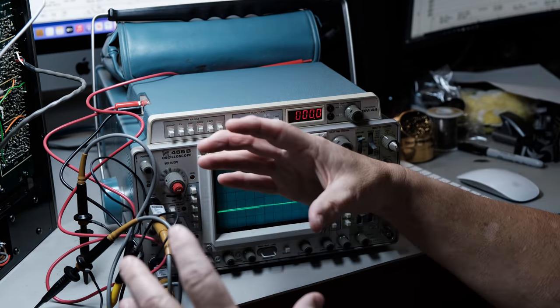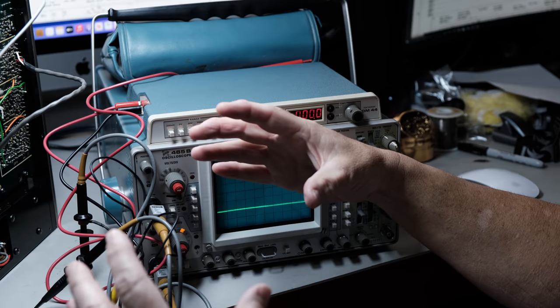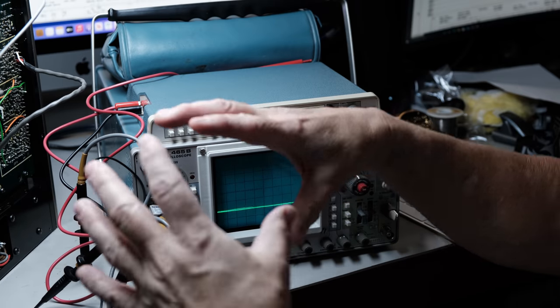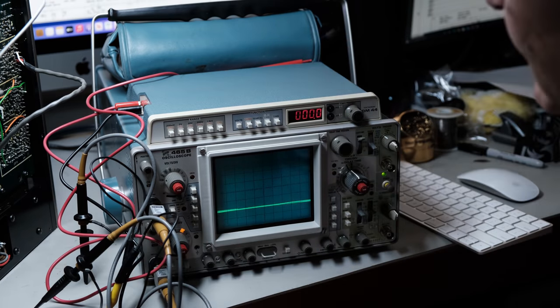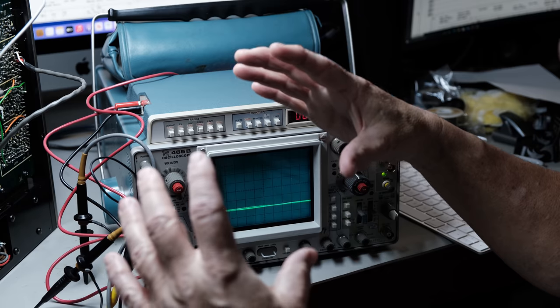First, I figured out that the CD player worked through the aux, right? So that eliminated a lot of this preamp. And then I tested out the Phono function. That didn't work, and I found out the right channel didn't work. But this is what you do. This is what makes something daunting possible to work on.